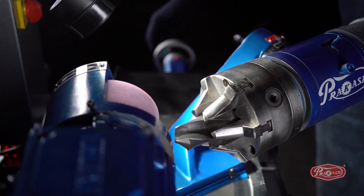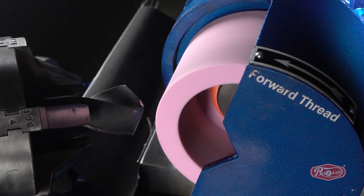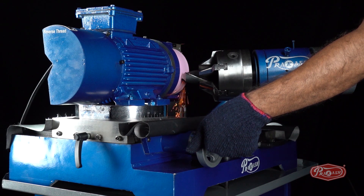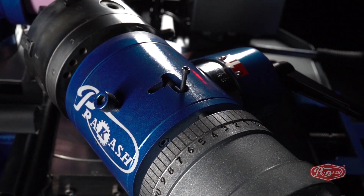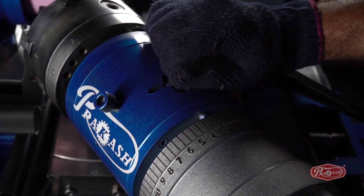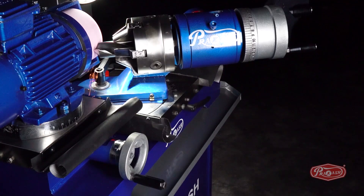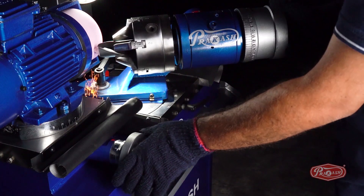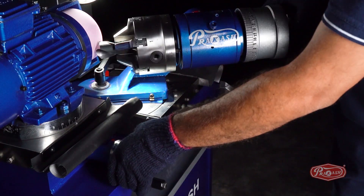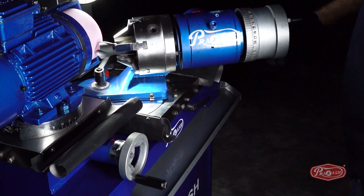Move the X and Y axis away from the pink wheel and then start the machine. Now, using the X and Y axis, make the drill bit touch the diameter of the pink wheel. We will then remove the spindle dial wheel pin which was set at number 3 to unlock it so that it can rotate freely. Keep rotating the spindle dial wheel in a clockwise direction and rotate the Y axis gradually in an anti-clockwise direction to bring the spindle dial wheel closer as per requirement. This will bring the pink wheel and the drill bit closer and back relief will be generated.